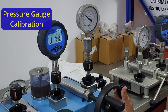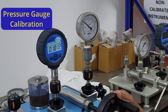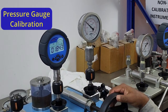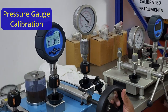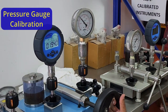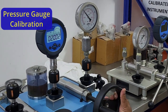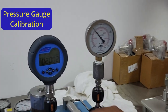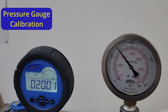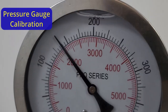We need to raise the pressure very slowly so that the spring of the pressure gauge will not receive a sudden pressure surge, which may damage the spring of the targeted pressure gauge being calibrated. Now we are approaching 2000 PSI — we have to go up to 3000. We will wait a while and hold this pressure to allow it to stabilize, then we will check. As you can see, the pressure gauge reading is also 2000 PSI.